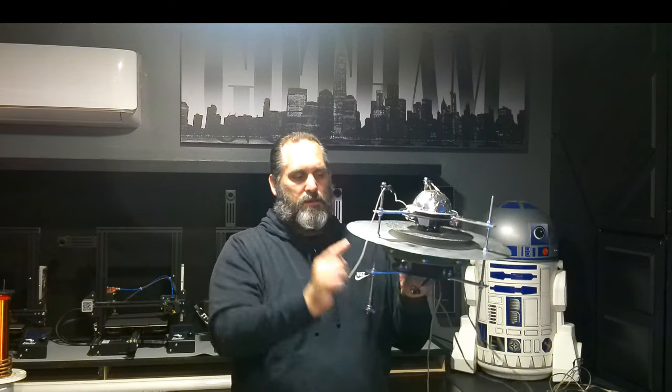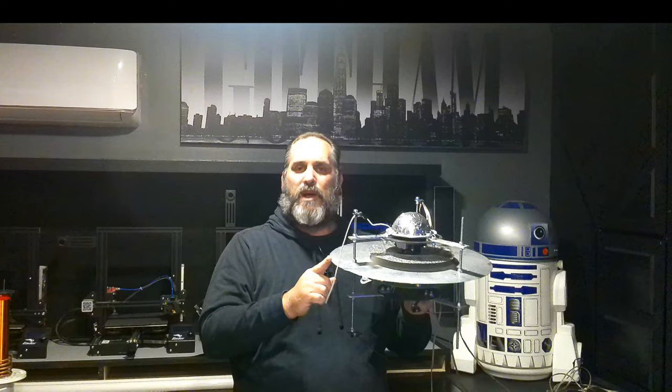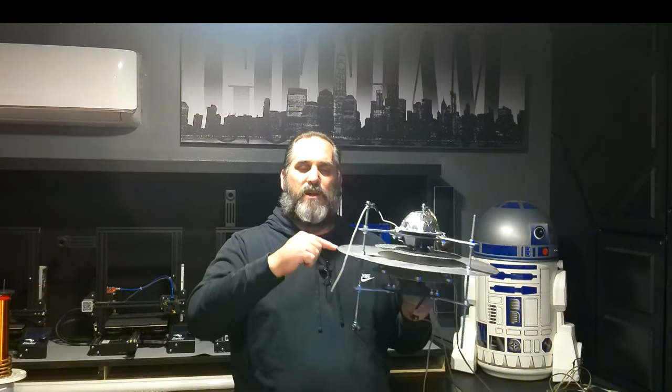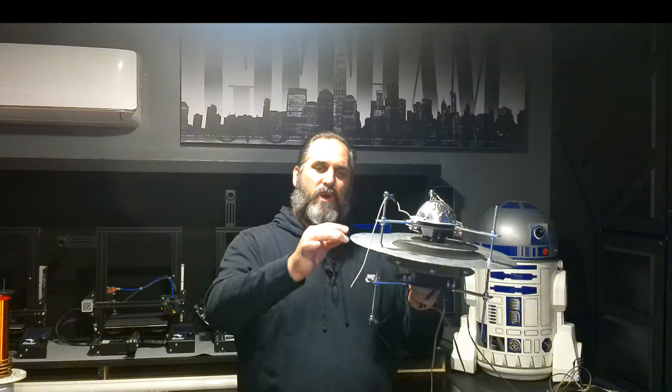The top plate and bottom plate are now locked in a capacitor — they are your upper and bottom plates in the capacitor. The center disc would be your dielectric. Most times when I say dielectric you'd think of an inert material with a high K value, but in this case the center plate must have a charged field on it in order to amplify the capacitor.